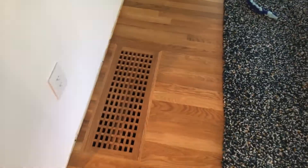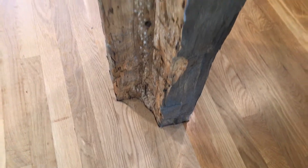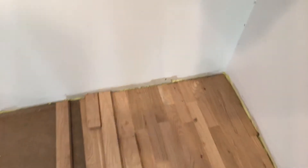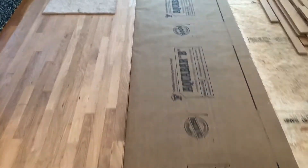Here's a section we've already redone. There's a grate built into the floor — I'm going to show how we do one of these returns that's built into the floor, totally flush. They look really nice when done like that. This floor has been in for about a year and now we're taking it to the new area. It took a long time to cope all the weird joints around the post and beam pieces, but everything's in now. You want to make sure you have plenty of expansion joint all around the floor — where it was butting up against the beam I didn't put too much expansion joint.